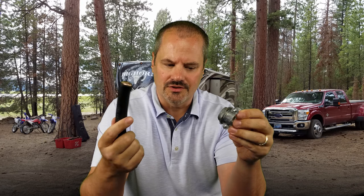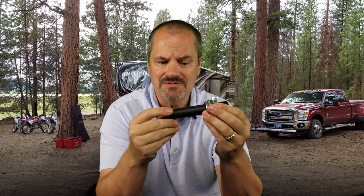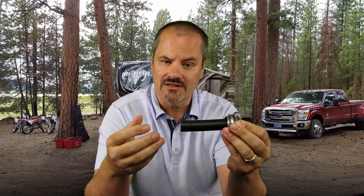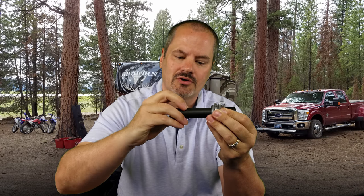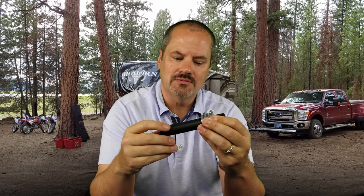The last thing you'll need is a low-cost item. I got three of these from Home Depot — they were $1.50 each. Basically, this connects to the transfer switch and serves two functions: when the cable goes in and you clamp it down, it keeps the cable in place so it won't get pulled off the transfer switch if something gets nudged. It also keeps the cable secure so it doesn't get nicked on the switch. They're made out of metal, so it's a good way to keep the cable protected.